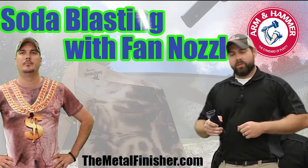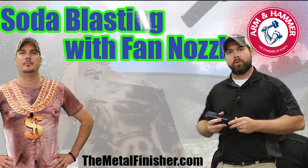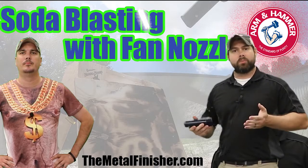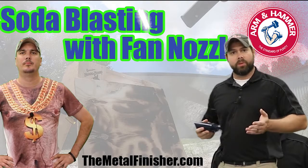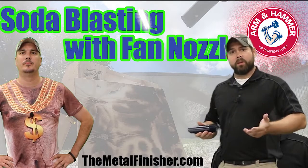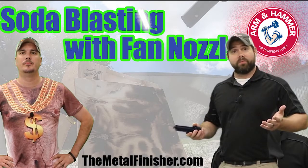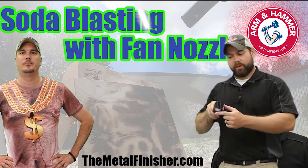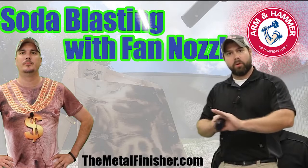Alright Blasters, so we used our 3/8 fan nozzle — only comes in the one size, does come in contractor thread or standard inch and a quarter thread. It's got the tungsten carbide inners along with the poly jacket, so it is usable with all sorts of materials. I probably wouldn't use silicon carbide or aluminum oxide — those are a little bit too aggressive for the tungsten carbide. But you could use any of your regular abrasives. We were using baking soda, and I think it was very effective. You don't have your hot spot because it's not round — with that little bit of overspray like a typical nozzle, you do have that flat groove, and it comes out in a fan shape.